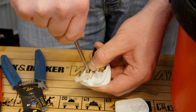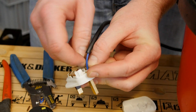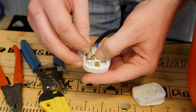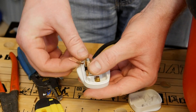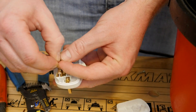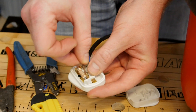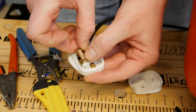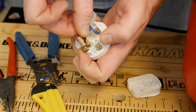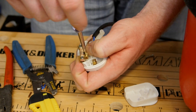I've done the neutral upside down to make it easier, so I then need to turn the wire around and feed the live into the relevant clamp in the same way. Again I'll double over the wire to make that a little bit easier, and then tighten this clamp too.